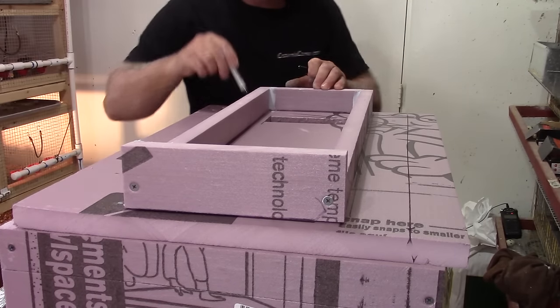Before mounting the door, I decided to put a viewing window in the front. I found a piece of leftover plexiglass, laid it on the door, traced around the outside, then measured in about a quarter inch and cut that all the way out. I went back to the original line and cut only halfway through the foam, then cleaned it out to create a little shelf or ledge for the plexiglass to sit on. I'll take some clear silicone and silicone it right in place for a nice little viewing window.